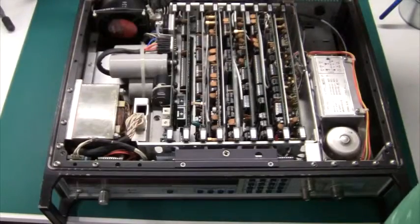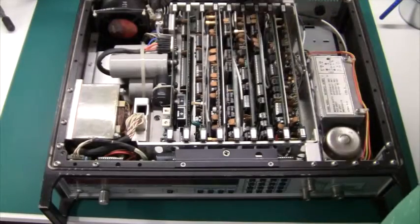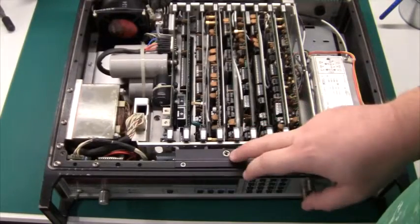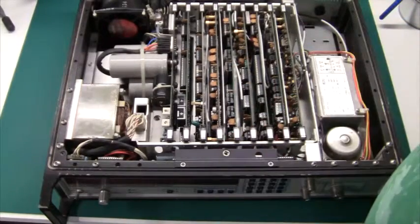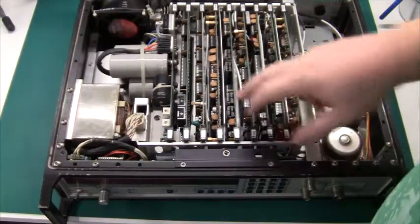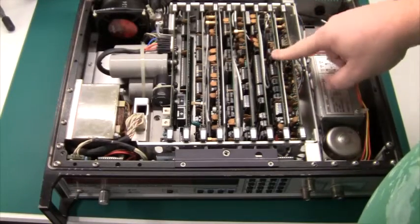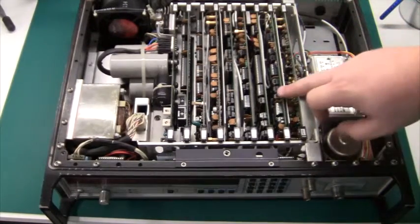The next board in the stack is a reference loop and a DAC. The next one is a phase lock — I will go into more detail about the phase lock on this frequency counter because it's a very special feature. The next one is a microcontroller; I'm going to remove it later to check whether some of the EEPROMs for the options I need are included. Next is the actual counter card, then a gate generator, and a special converter board for band number three.